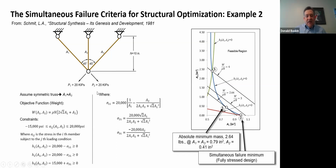and you can say that the stress in these members has to be within some range, so this thing doesn't break. So for whatever's in tension here, given whether it's P1 or P2, the stress has to be less than 20,000 PSI. And for P1 or P2, which puts whichever member in compression, the stress has to be greater than negative 15,000 PSI. So compressive stress, 15,000 PSI, right? The stress in the I, J member, where I is which member it is, so 1, 2, or 3, and J is the loading condition, so P1 or P2, is given